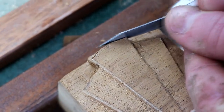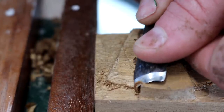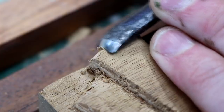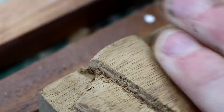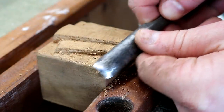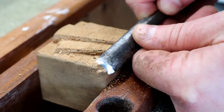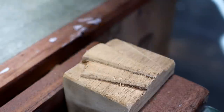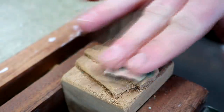I don't have many carving chisels — I really need to buy a set — but I do have a gouge which I could use to round over the edges slightly. I then refined things with some sandpaper, sanding at 120, 180, and then 240 grit.